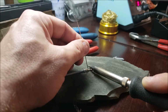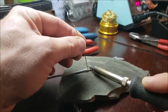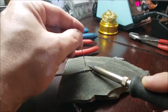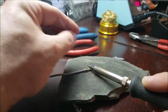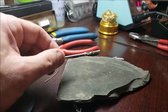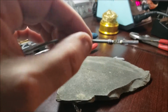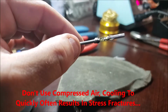Okay, I'm already starting to flow. Hopefully you can see that. I know my left hand's hurting the light. I'll try to angle it. There you go. See how I'm just flowing it in there? I'll get a little bit more, and then take it away. It'll be warm, you'll feel the warmth on your fingers even through it all. I'll blow it a little bit, but there you go. That orangey color is the flux core.